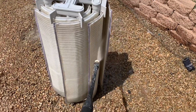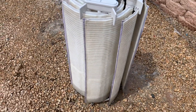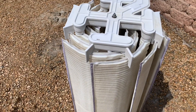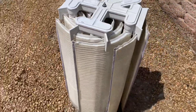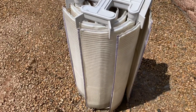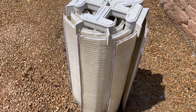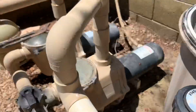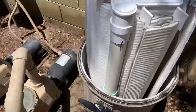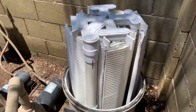Ideally the best way to clean this is to disassemble it and clean each grid individually — front, back, upside down — but I just don't have the time or patience. This is a quick way and it should work. I live in the Southwest where it's extremely hot — already probably 100 degrees this morning — so this will dry very quickly. If you live in the Midwest or East Coast it'll take longer to dry. We're back in — line it up with those marks. I cleaned out the housing too. Now I'm just going to put the cover back on, tighten it up, put some DE powder in, and good to go.